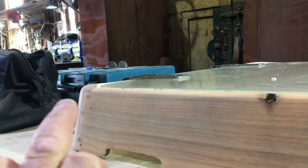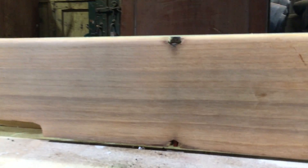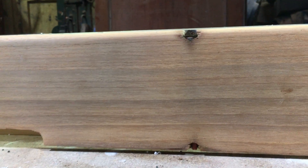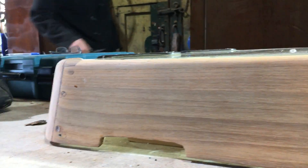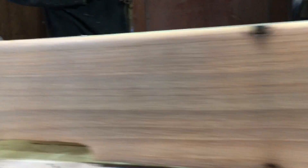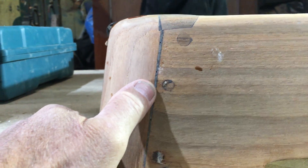These edges — some of them are okay, but the one on the other side has got a big scallop in it, I'll show you in a minute. But these are the copper bolts. So we'll be putting graving pieces in, and you start to see now your screws which we've got to try and get out.